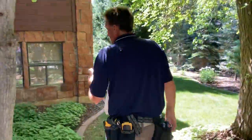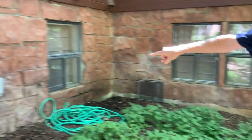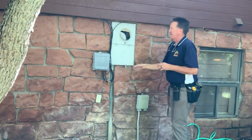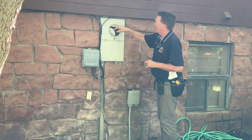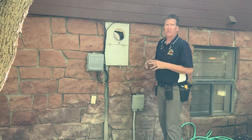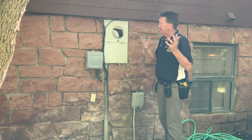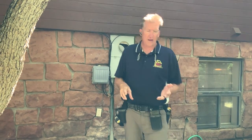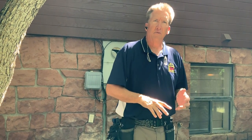Coming across here, I need to look out at the street and find out where the meter actually is. I believe it's down in the little housing at the sidewalk because the power comes in underground and then into the panel to feed the rest of the house. There are some breakers in here. This cover panel that is out of position — that's high power right in there. If you stick your fingers in there you're going to get fried, so if you have curious kids, obviously get this cover working right. There are a couple of other rather minor electrical repairs that I've detailed inside the sub panels — easily correctable.